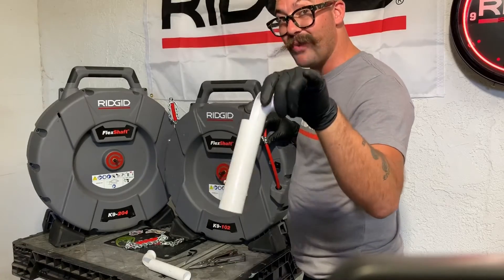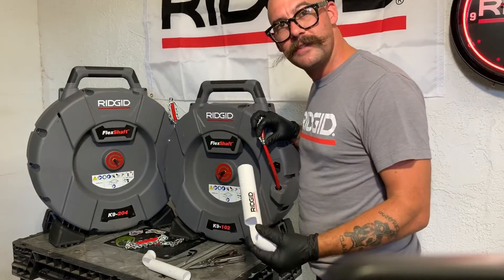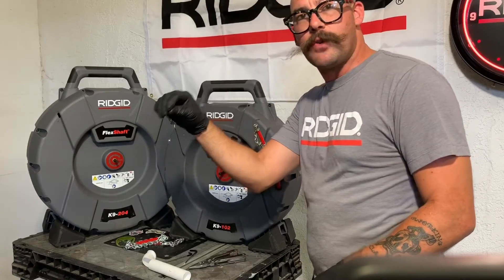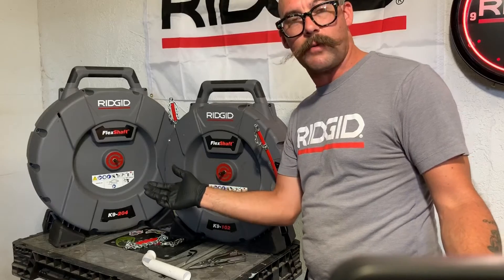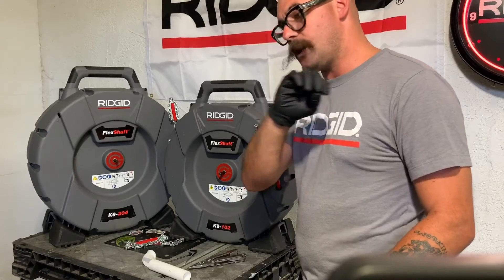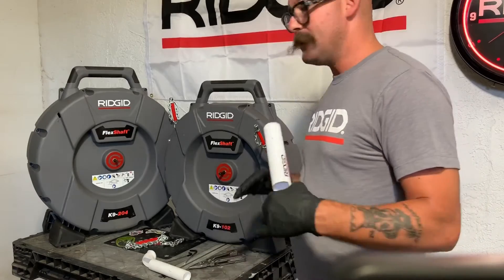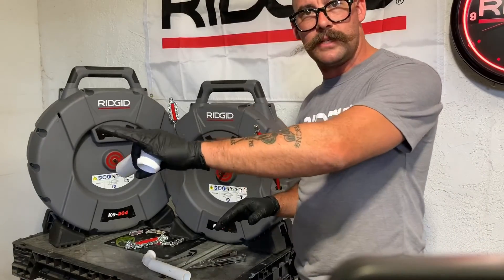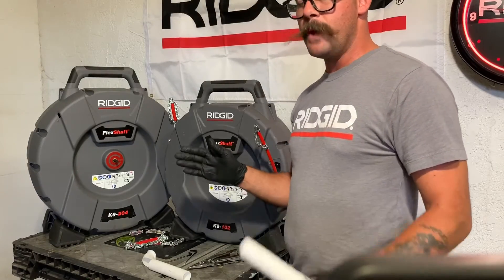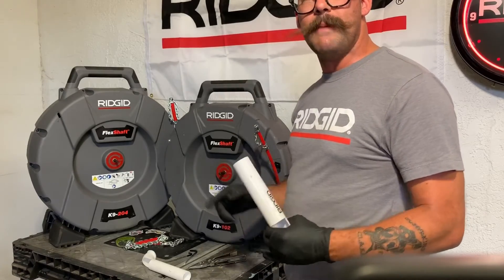I like cold water, not hot water. If you use hot water, it's going to liquefy the grease and get all over your equipment — and it's just going to slowly seep down the drain and clog somewhere else when it dries up. With cold water while descaling, it's going to clump and run out of the line, hopefully all the way to the city main. Our main objective is to get everything out to the city main. By using cold water, in my opinion, that's what's best for your customers.